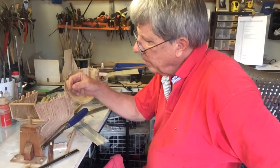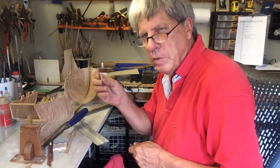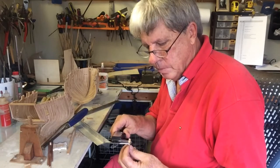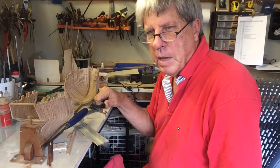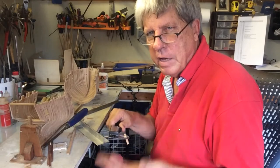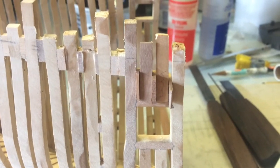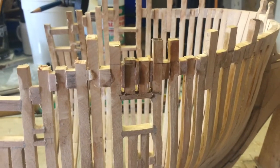Today we are going to put the extension of the frames above the gun port. We had marked each of the excess pieces that we had cut off. Now all we do is measure the thickness of the distance between the frame, then measure the thickness of the two frames you're going to put in — the extent of the pieces cut off — minus the opening between the side frames of the gun port from the thickness of the frames. Divide that number by three and that will give you the size of the spacings. We've done that, we have the spacings, and now we're simply going to draw a line at the top for the height we need to cut the frames, then stick it and wait for it to dry.